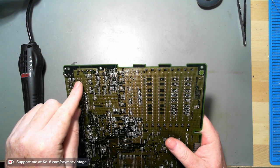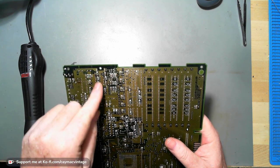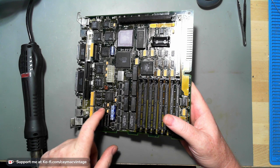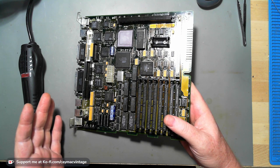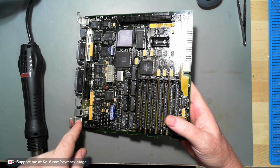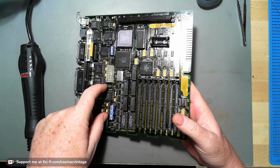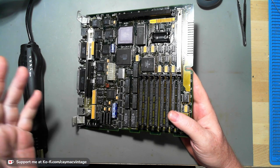all the traces for this, I traced it back from one side of it to here and from the other side to all the circuitry that it goes to, and I have continuity, I have values, okay? I even scoped it out, and it is putting out on pin 10. It is putting out the audio that then goes to these caps and then goes to the jack. That's there, but it doesn't get to the jack, which I find strange, because it has to get to the jack for it to come through the speaker. That's how this system works: it goes from here to the jack and then from the jack on to the speaker. When you put in the headphone, that's what kills the audio going to the speaker. So anyway, I can't figure it out.